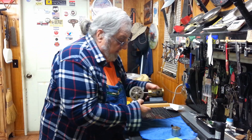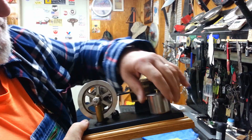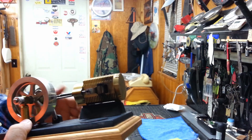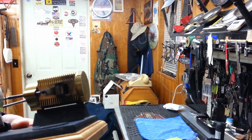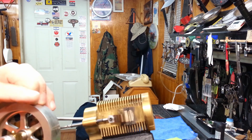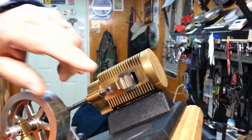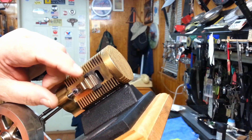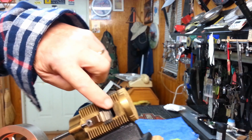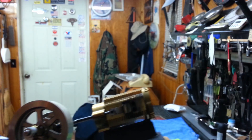What we got to do today before we run it is clean it. Look at that — she's got moisture on it. And that there's a fire pot. But you see this up here? See that little thing right there? Maybe if I turn some more light on here it'll light up so you can see. This right here is where the flame goes in. As that closes, it builds up pressure and it comes out. But to get it timed — you see that ledge right there? That's got to be flush with that ledge. If it's too far up or too far back it's not going to run. But this is dirty right now, and we're going to have to clean it up real good. These motors don't like dirt.